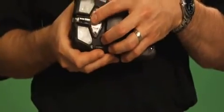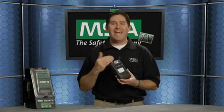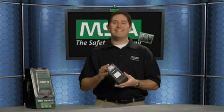For more options and flexibility, there's a pump on the back of the Altair 5 — the same pump we've been using for several years in the Sirius multi-gas detector, PID, and Orion multi-gas detector. This pump is very powerful and rugged, allowing you in some situations to remote sample up to 100 feet. You also have the option of getting this detector as a diffusion-based instrument — so if you don't need an integral pump and want to save a bit on cost when ordering, you have that flexibility with the Altair 5.